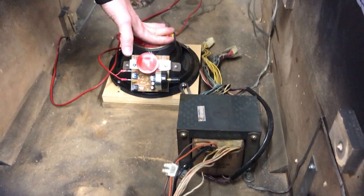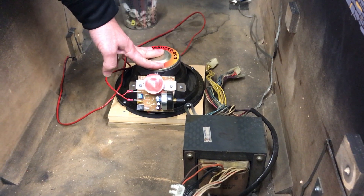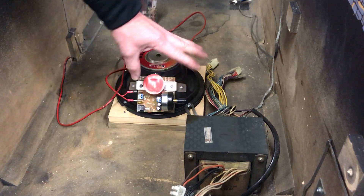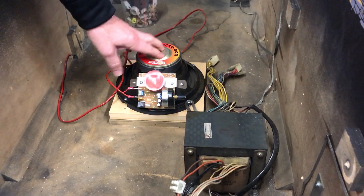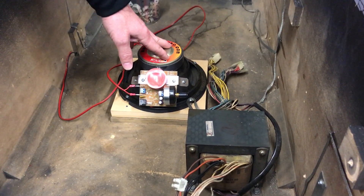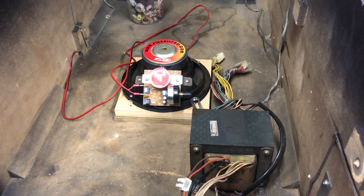The transformer's left — I'm going to talk about that in just a second. This speaker, I'm not going to reuse. No offense to the people that make it — it's a good product if you need it, but it doesn't work that well in Addams Family unless you're going to run the Pinsound board, and I'm not going to run the Pinsound board. So it's just a big magnetic footprint in the middle of the cabinet that I don't need. I need just a nice clean factory speaker, or maybe a slightly upgraded speaker, but the powered aspect isn't desirable to me because I find that it muffles the sound more than it enhances it, unless you do the complete and total package upgrade, which I don't plan on doing.